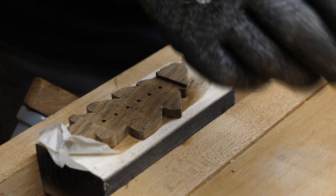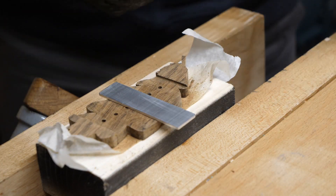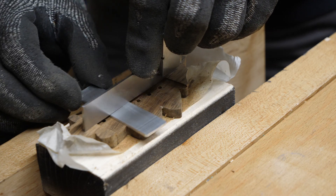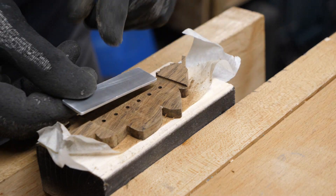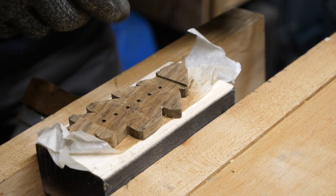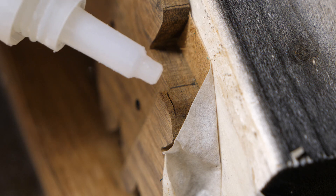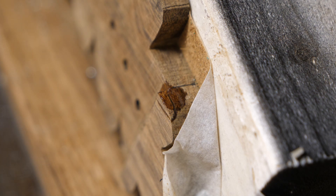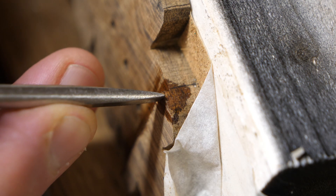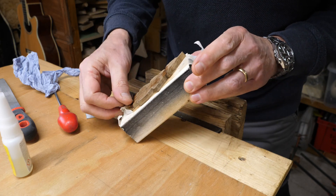I've got that nice and flat. I used a shinto and a levelling beam just to get it right down at the very end. If I put that across there, it just sits slightly underneath — which will be great because it will pull it in, and I've got some flexibility in how I deal with that. What I need to do now is chamfer the edges of this piece of metal so that they fit in those chamfered edges. I apologise about the noise — there's some heavy drilling going on outside. I just need to put a drop of super glue in there to repair that little break. I'll hold this for a few minutes until I'm happy that's stuck, then run some super glue down inside the edges just to strengthen it.